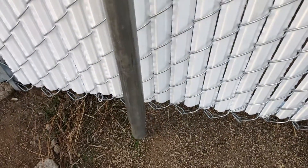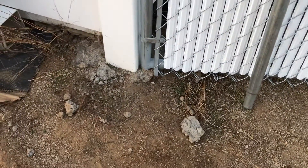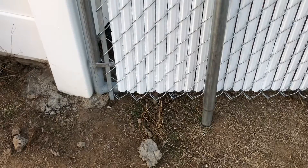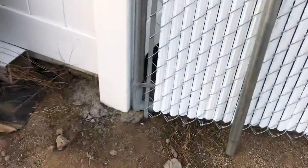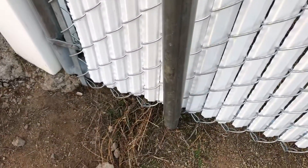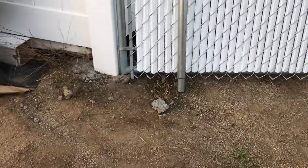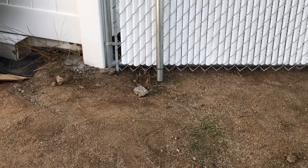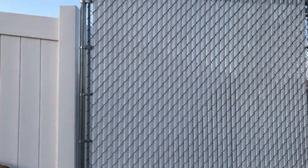You can either set this in concrete, but because this is on another piece of property we're gonna temp this in. A good place is close to the end for rigidity. It's not gonna have a latch or be attached to this fence at all — it's like a dummy panel. So we're gonna find our setter, pound this pipe in, get it underneath the bottom horizontal, and get that welded in for some bracing.